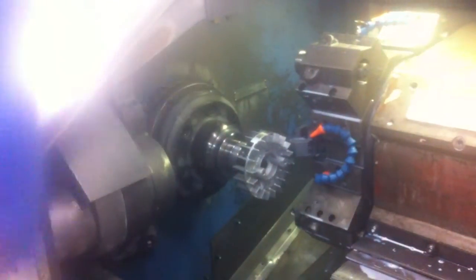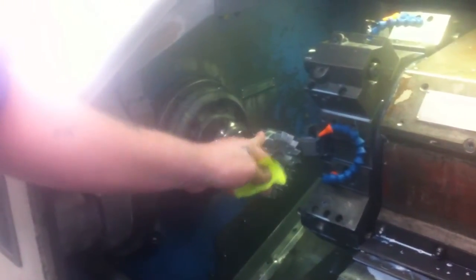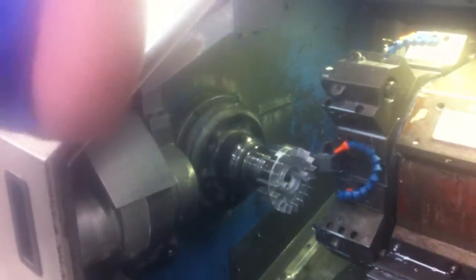You've got a CNC machined part — it's pretty true — but it's cast so it's not gonna be totally true. When you brought that part in, it shifted over and was kind of oblong. We put it in a v-block on the shaft, turned it, and we were getting a massive amount of runout.